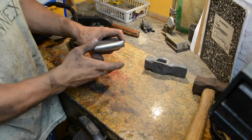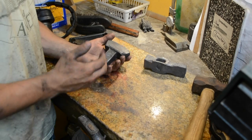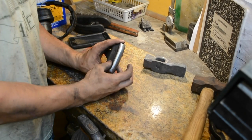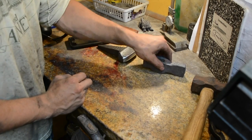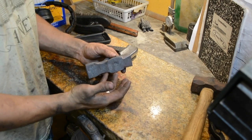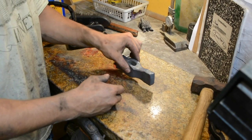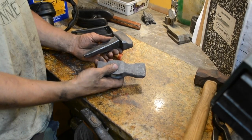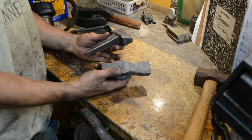Here's the finished fuller with the satin finish on the top. You may have noticed that I didn't heat treat the bottom fuller, and that's because it only contacts hot steel and the anvil. 4140 tool steel, just alone not heat treated, is much more durable than mild steel. On the other hand, a top fuller I do heat treat because it's getting struck by a sledgehammer. I use a heat treating oven and commercial quench oil to heat treat all of these. If you'd like to purchase a fuller or any other blacksmithing tool, you can contact me directly through email at liam@hoffmanblacksmithing.com or go to my website www.hoffmanblacksmithing.com. Thanks for watching.